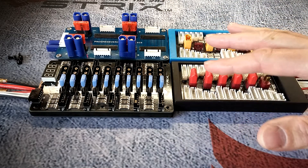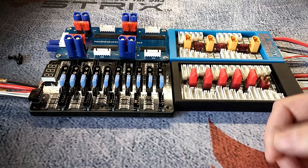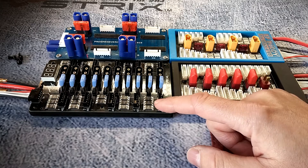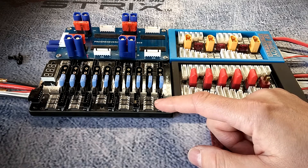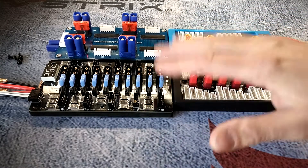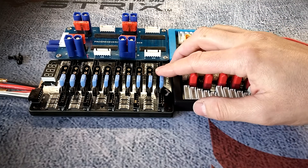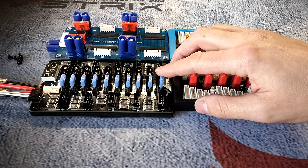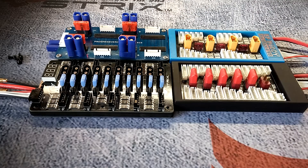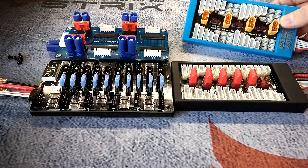It won't replace all of my boards because I have 6S batteries and 5S batteries where this board is specifically made for just 4S batteries. But what's good about it is that it has 10 ports, so with one of my iChargers I could charge 10 1500 milliamp batteries at 30 amps, which is a 2C rate. Within about a half hour it's going to get everything done and get you out the door and flying quicker instead of worrying about charging.